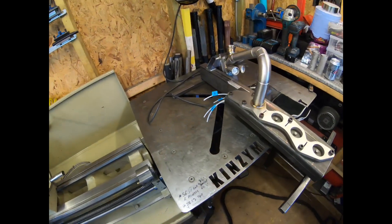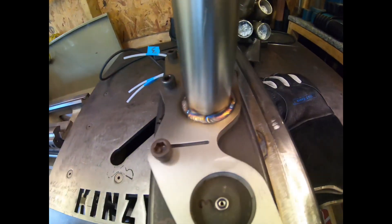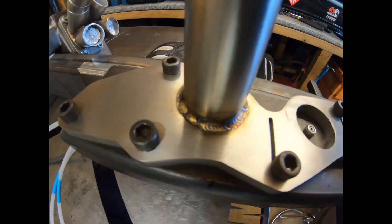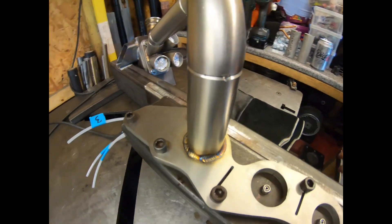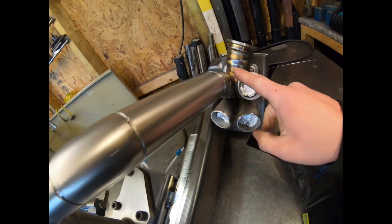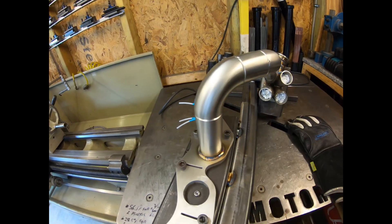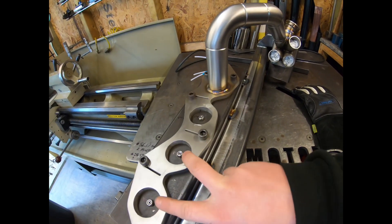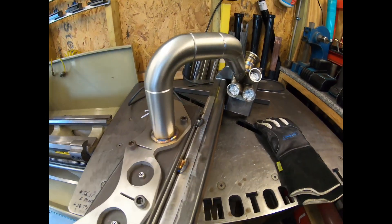I'll do a couple of clips of the welding here. I'll just show you this one — I've just welded this one fully to the flange. I'm trying to work this out as I go, so I'm going to start. This one can be welded completely in one hit all the way around, then I'll do the next one, weld in places, then potentially the end one or one of these will be able to weld all the way in situ, so I only have to actually break off and weld two separately on the bench.